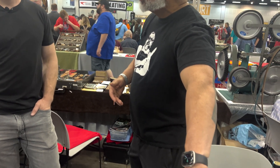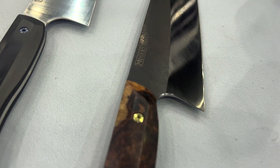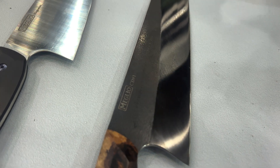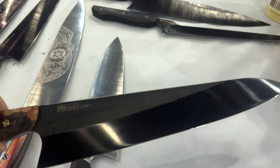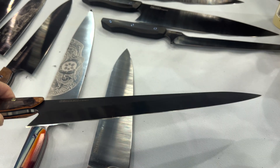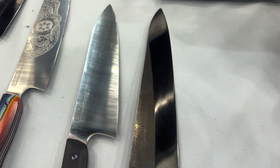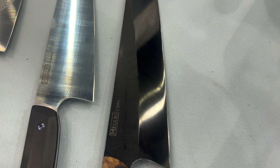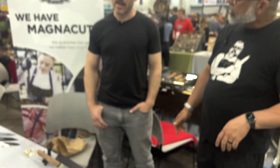Brandon is notable as the first American knife maker seen putting a shinogi line on culinary knives — the 50/50 bevel is typical on American knives, so the shinogi grind stands out. This higher grind style is very popular right now, especially on Japanese knives. None of his knives are cladded — it's all mono steel with primary and secondary bevels. He wants to use the absolute best steel throughout, noting that damascus always means mixing a great steel with something lesser.